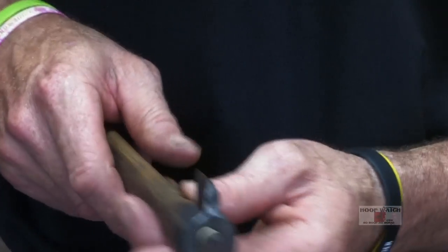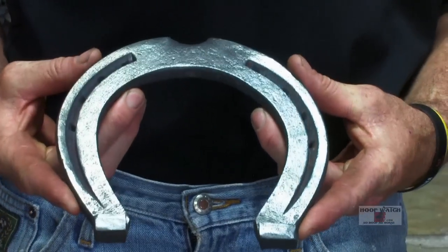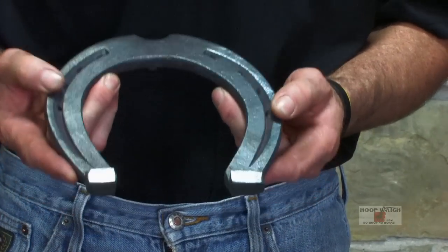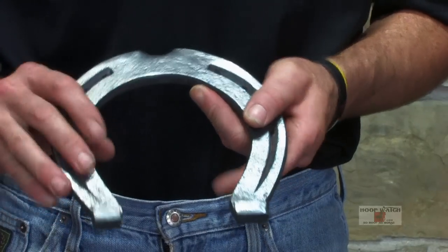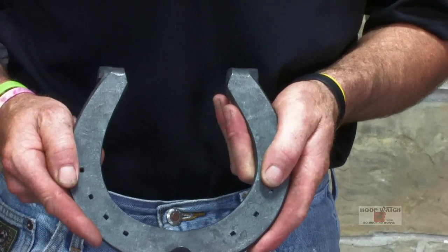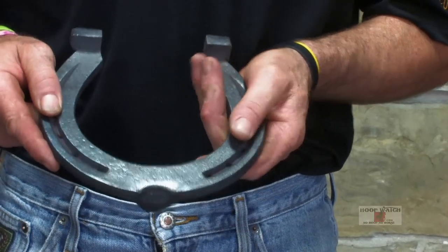What we're going to do is in a 1 hour go, you have to make your fuller. The second part of the test is that you have a Clydesdale shoe front out of 19 inches of half by inch and a quarter, 8 nail holes. It's set up for an E10, and it is a left front with a hammer-drawn toe clip and the agricultural heels. Handmade fuller. There'll be no fullers allowed on the floor.